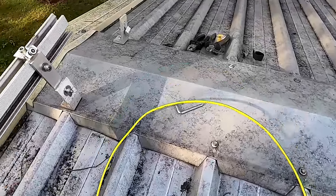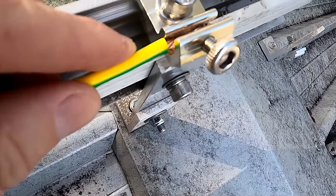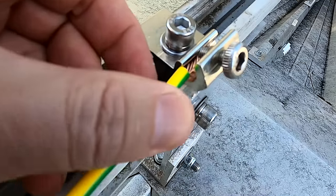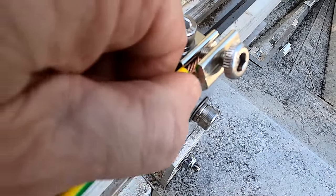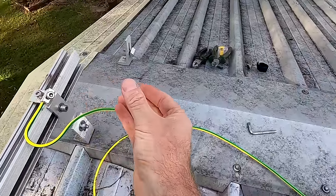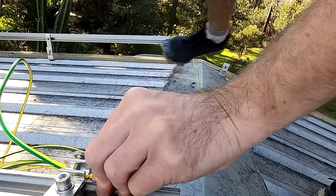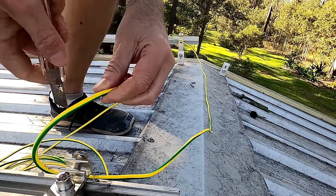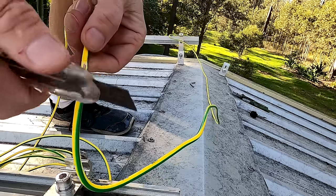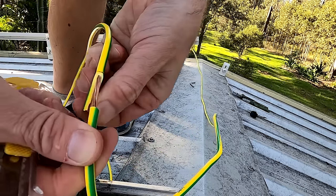So we are now going to fit our first earth cable - I've already twisted these cables together, this is a 6mm building wire earth ground. There we have it - this is our first earth connection. Then we feed the cable across the solar panel on the underside in a split tube so it's protected, and then we go to the other clamp on this side. I'm cutting off the insulation now in between these two points - watch my fingers. Yeah, there we go, it comes off.